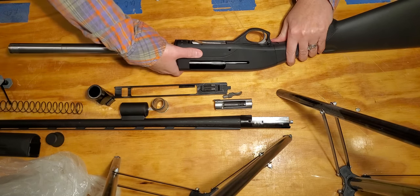There is enough play to move it up and down and forward and backward to line up the holes for the retention pin. Visually check the alignment and set yourself up for success — there's no need to use a hammer on anything. Slide the retention pin back into place — it should just pop in flush and flat on both sides. Now that the trigger mechanism is back in, put the spring back on; it doesn't matter which direction. Slide it onto the magazine tube all the way back up to the butt of the receiver.